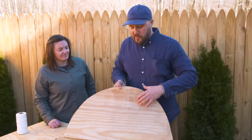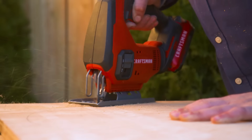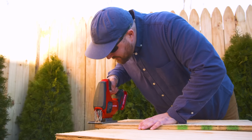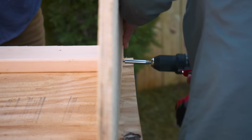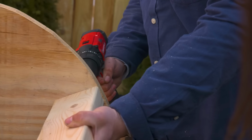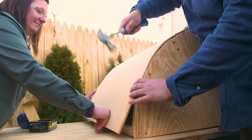Now we have our oven opening. We're gonna make one exactly like this by tracing it on another piece of wood. We'll attach each arc using 2x4s cut to size. Our last step is to take Luan and bend it over the structure. When complete, we'll have a solid mold to build our brick around.